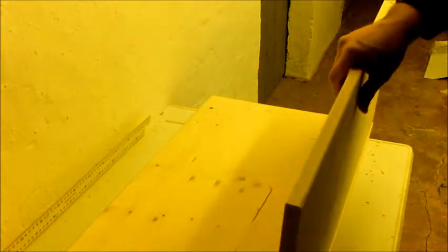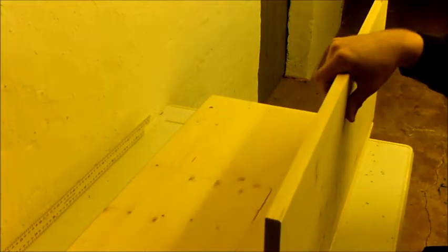Right, and you just basically line up these dowels. Now I've got my dowels in, and they're not overlapped, because I've marked it out. So this is what you're looking for when you're joining it up. Once you've done all the dowels and they're all drilled in, you've got the base on the top and you've got your two sides.